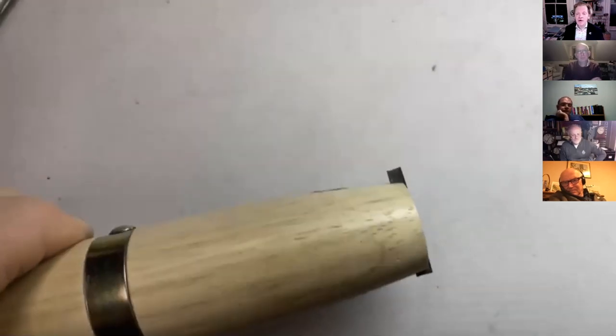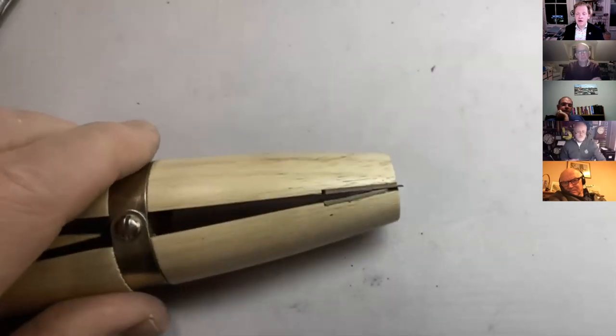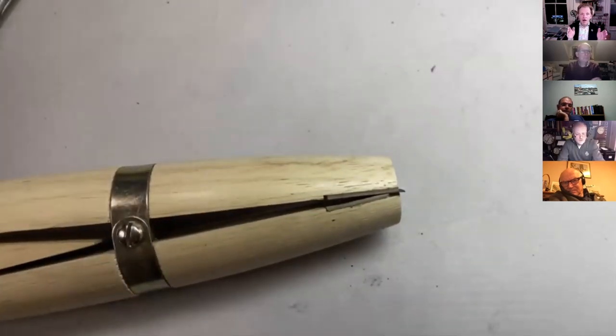So there's our bit of steel, which is now annealed. And it's about 0.5 millimeter over width for our pallet face. So first thing next week, we're going to shape it to the same shape as a pallet face. And we're going to solder it on with soft solder. Then we're going to take it off. Then we're going to harden it. And then we're going to have a working escapement, he says.